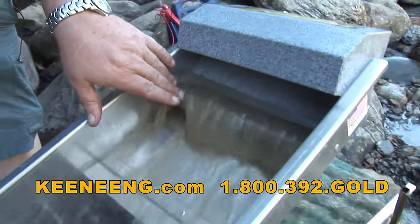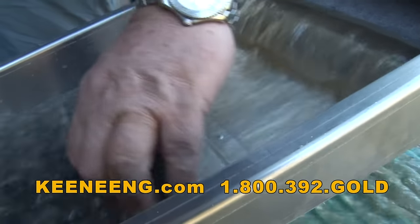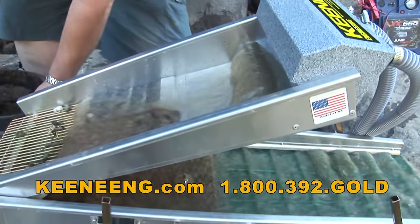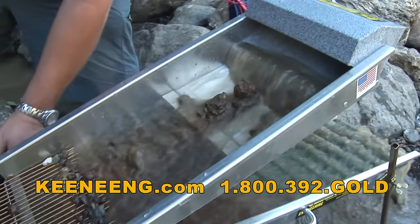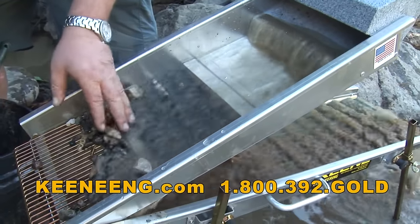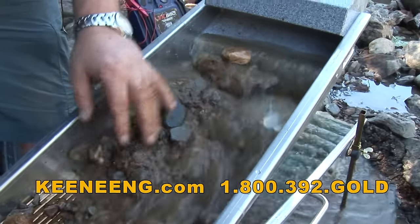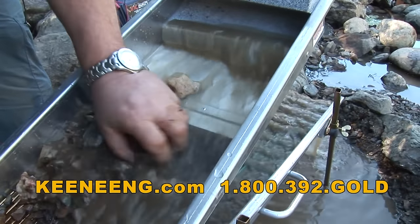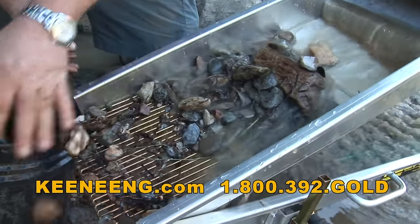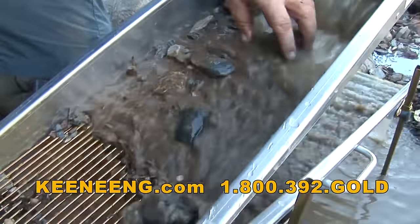The flood header in here helps regulate the flow and gives you a nice even flow, but you've got to make sure you get the air bubbles out. Run your hand in there, then let's run some material real quick. What's good about this is you don't have to worry about classifying your rocks - you just let it build up on the classifier and then scoot it off the edge. You can also use this to wash out your rocks real good and inspect your stuff as you're scooting it off.